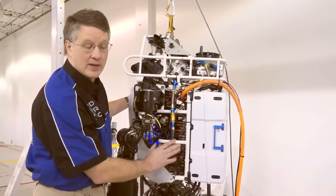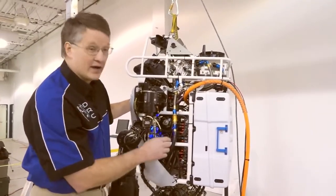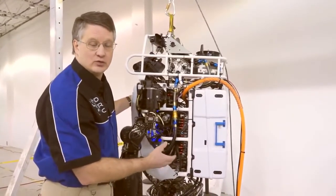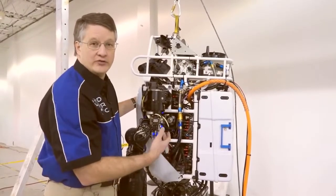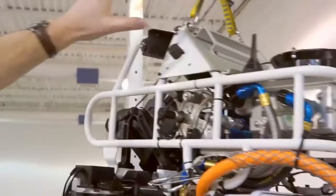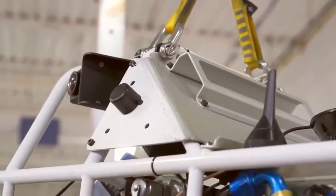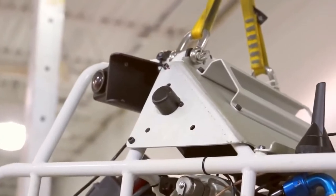The teams can actually operate this robot without the need for any hearing protection. It's a variable pressure pump, which will allow the teams to change and decide what pressure they will use during any of the tasks of the competition, and that will allow them to save battery power by using less pressure. Up here we'll have a set of computers that the teams will use to process images out of the sensor head and command the robot to do its tasks.